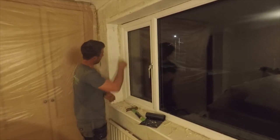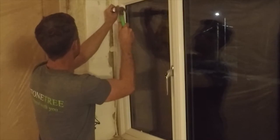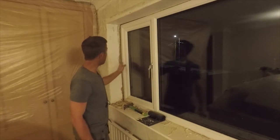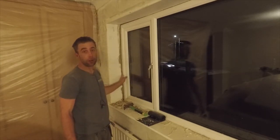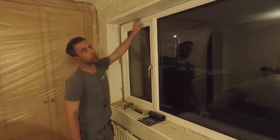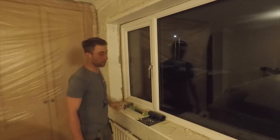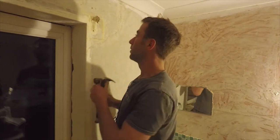When we get to the side bits, these are usually quite loose anyway. Do the same — provide a key going up there. That exposes the gap around the edge of the windows between the window and the masonry, so you can fill any draft through that. A good thing at this stage is to get some expanding foam and fill those gaps. We can pack in some mortar at the top, and expanding foam on the side. Corners and just above corners always go as well — so just chip that away.